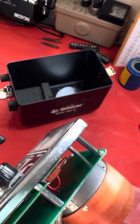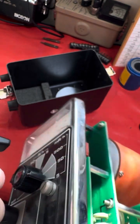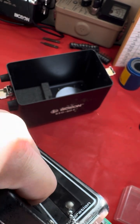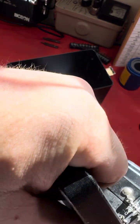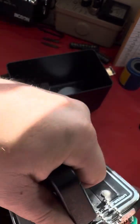And most any air-vented ion chamber you will see is going to have the need to have its desiccant replaced every so often, because the detector itself, the ion chamber part of the detector, is very sensitive to moisture.